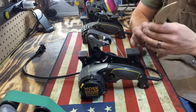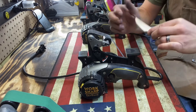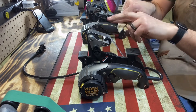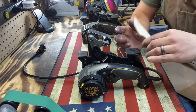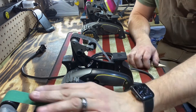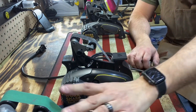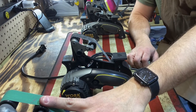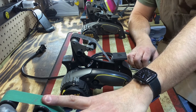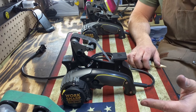That gives you whatever angle you set — in this instance, 22.5 degrees. When you're running it across, you want that burr to come back up. When you run your finger across it you should be able to feel that burr, then you flip it over, run it again, and get the burr back up. You keep doing that — that's called stropping — and you keep progressing through the belt grits. This green one is a 120 grit from Red Label Abrasives. I don't run this on every blade — only on new customers to reprofile to the target angle.